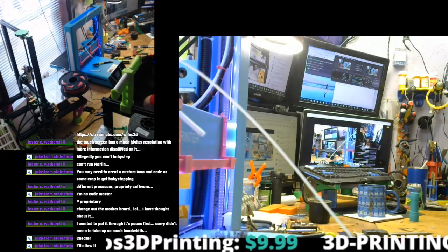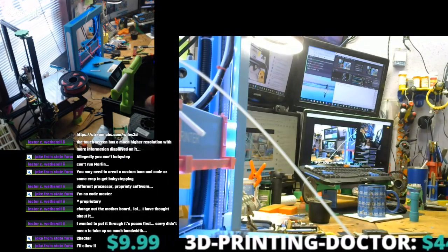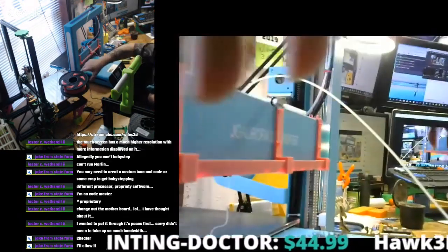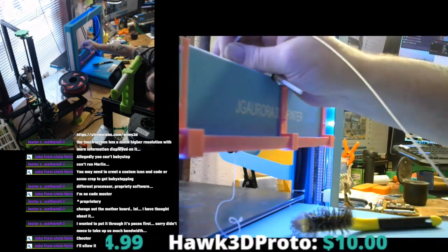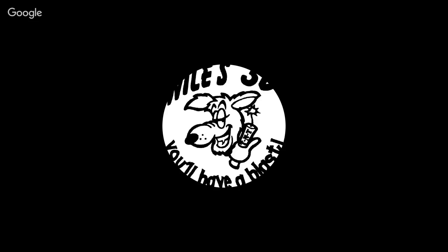I'm just trying to cook this hot end out a little bit. Glad I didn't touch it now. I got it up 250 degrees, man. That would have sucked, royally. Move that over. Ever scrub your hot ends with a wire brush? Just like that. It's nice today. I don't want to play nice. All right. Cool down. Turn down to a hundo.